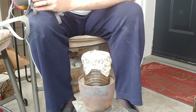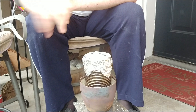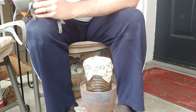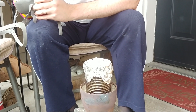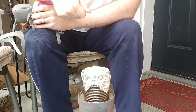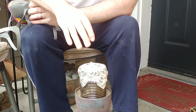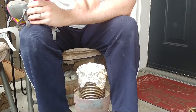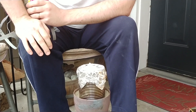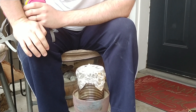So without further delay I'm going to get started. What I'll do is slowly bring the flame down onto the pile so that I don't blow the entire pile away. As I'm bringing that oxidizing flame down onto the pile kind of slowly, it'll sinter the outer edges of the pile at least to some extent, and that prevents the entire pile from blowing away.